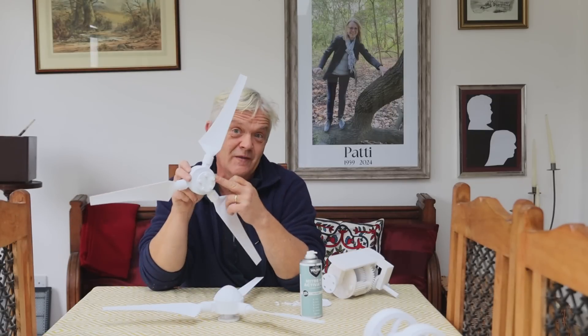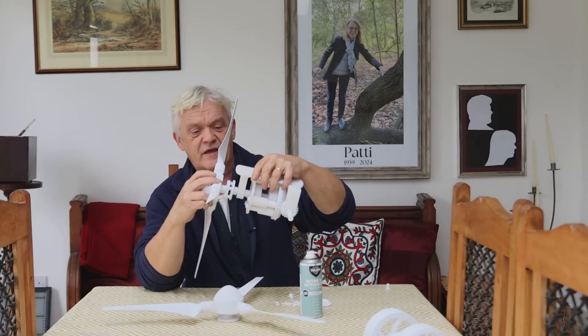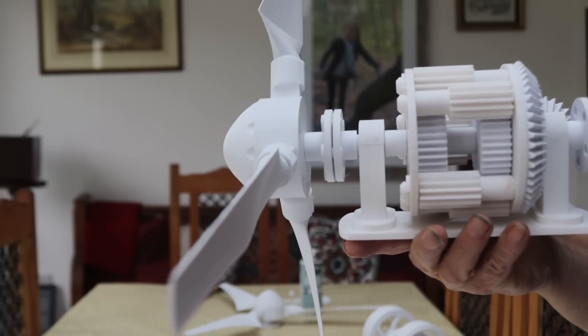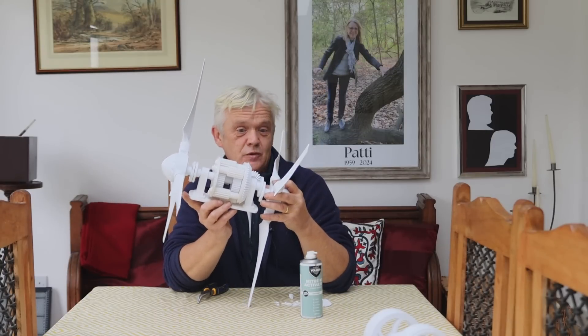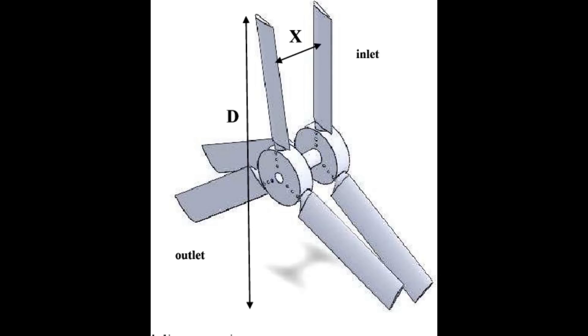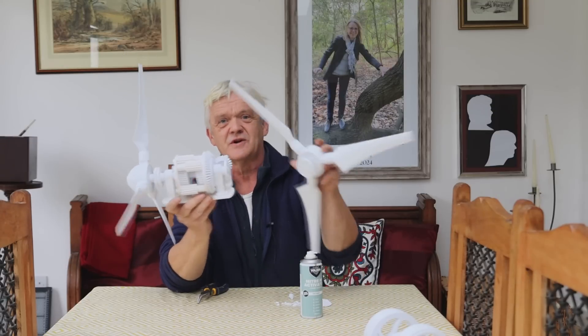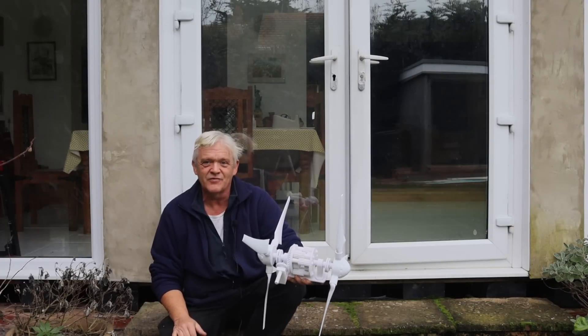To attach the blades, I made 10 little pegs that go in the flange — they drift out slightly. The two flanges are made up with some clips to hold them in place, giving you something like that. Then we do the next side and we have our dual rotor turbine with a spur differential in between. Research says the distance between the two rotors should be a quarter of the diameter of the swept area — that's the optimal distance.